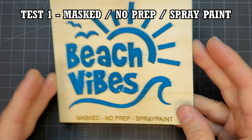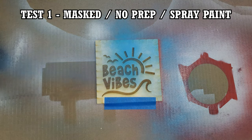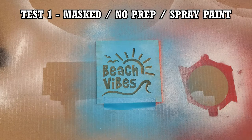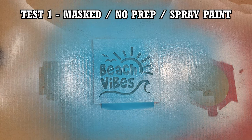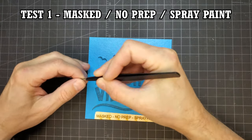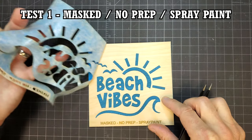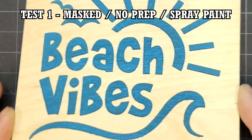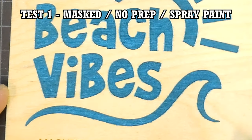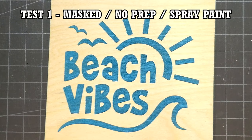You're probably thinking of course I got a bad result because I went too heavy with the paint. For the next test, I used the same non-prepped wood and gave it about three very light coats of spray paint, letting each coat flash off before applying the next. When I removed the mask, you can see I got a really good result. If you look closer though, you can still see there was some bleeding, but not too bad. It's most noticeable around the wave at the bottom. The light coats weren't quite wet enough to wick into the surrounding wood, while also acting as a sealer when each coat dried.